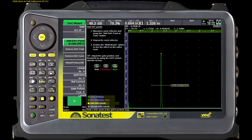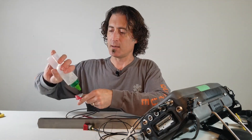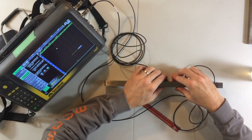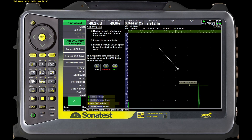Our first point is one pass through the block at 60 degrees. Then we'll take one of the probes and flip it around to the other side, make sure we've got lots of coupling on there, and we will draw the letter V at 60 degrees — this will be our second point. Then we'll take this probe and flip it back around to the other side, use up all that good coupling, and add our third point.